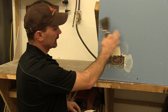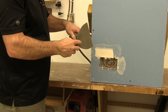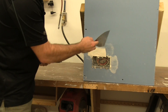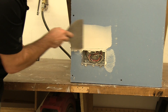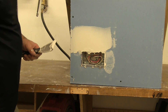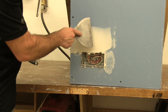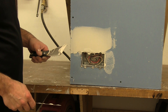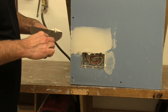As every other step when you're doing all the rest of the mudding in your project, you just come back and add a bit of mud, feathering it out so it's not a huge issue. If that was dry and I was coming back to do my next coat, I'd start a little bit wider and just get some mud build-up on it. My next coat I'd go maybe a little bit wider, try to feather in the bottom corners, and it's probably covered good enough.